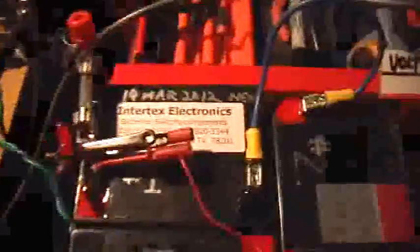Okay, so now what I'll do is I'll go from the blue inductor to the brown inductor, like that. And that is such a small inductance that we still get our good continuous waveform all the way across the pulse. If this pulse were long enough, you'd probably see it decay, or you might see it continuing to oscillate. But at any rate, this looks very much like what we get without any extra added inductance.